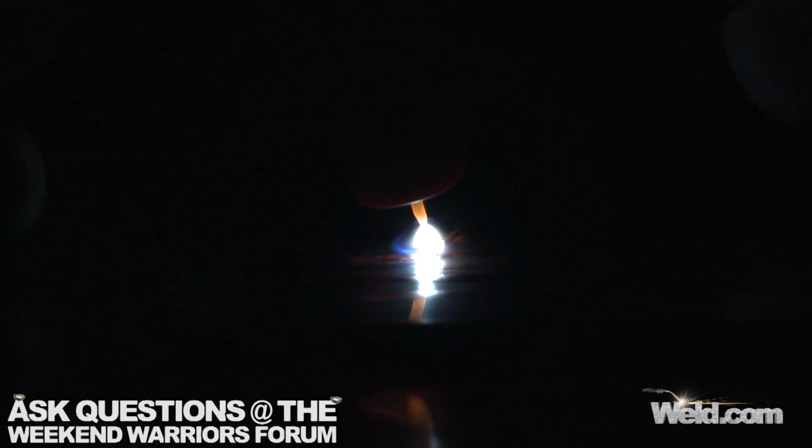On your show, you get a lot of questions on how do you see the puddle? What's the best way to see the puddle? Well, we're going to break off here in a minute, and we're going to have devices that are going to help you see the puddle because it's critical. In TIG welding, you need to be able to see approximately 12 to 15 inches away. And if you can't see, you're going to contaminate your tungsten. You're going to be regrinding. So we're going to clear off this table, and we're going to put some other devices up here and explain tungsten and tungsten grinding. Cool.